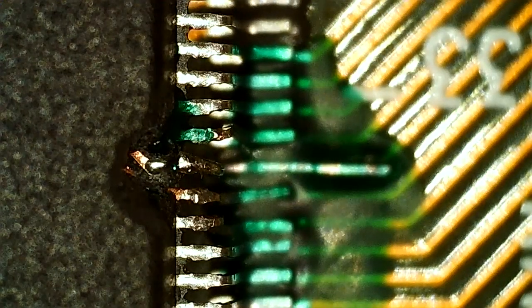The reason we're using epoxy later is because the conformal coating is difficult to harden all the way through if you get it thick. The UV light won't go through. So I'll start with this. I will leave this on here with the UV light for a little while.